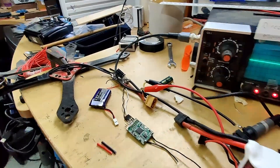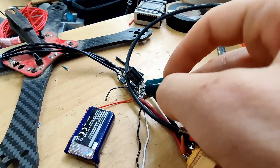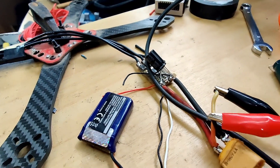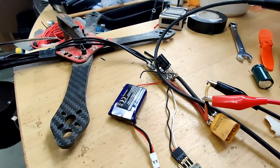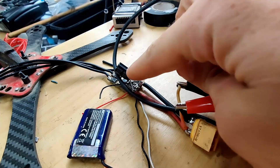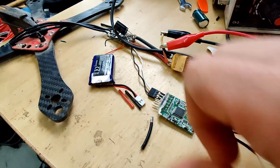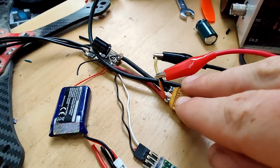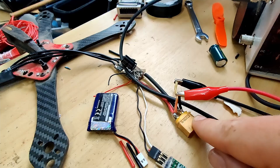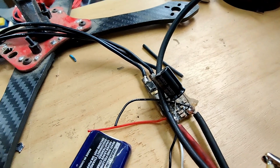I've just tested different lengths all the way down to directly attached to the battery pads, and I've also tried adding a second 1000 microfarad capacitor right across those pads as well. The results are somewhat as expected and quite interesting. Keep in mind that the capacitor was added to the battery pads of the ESC by an ever-shortening length of cable, however the oscilloscope is picking up at the XT60. I'm going to do a few more experiments to confirm some thoughts I have about this.